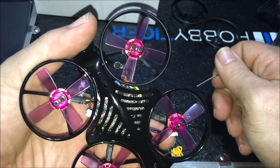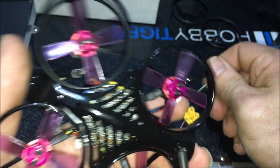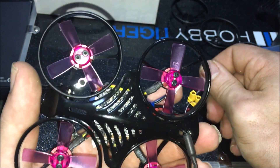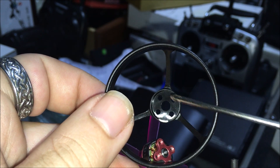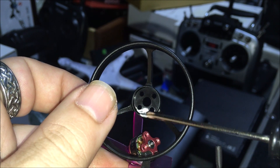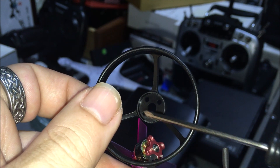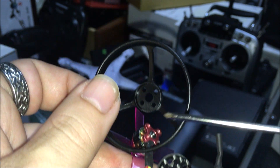There you have it — the new guard is on. You can tell the new guard from the old one because it doesn't have that high-gloss shine. With the magic of YouTube, I'll change the rest and then show you how to change the blades, which is super simple. I know some people are visual learners. Important tip: there is a notch in these rings, and you want to line up your wires through that notch when putting the motor on. My first one I didn't do that and the motor did not spin freely — it didn't matter how loose or tight the screws were until the notch corresponded with the wires.